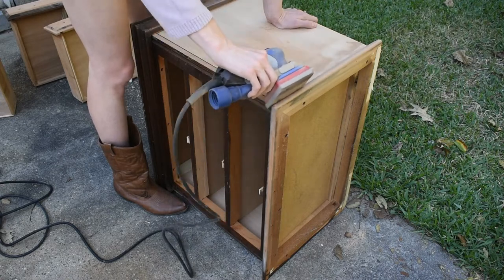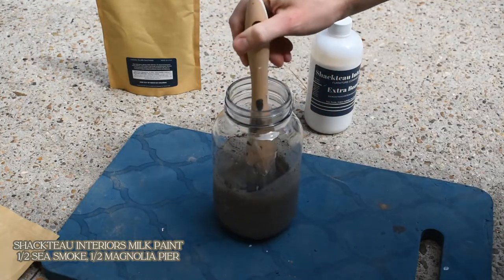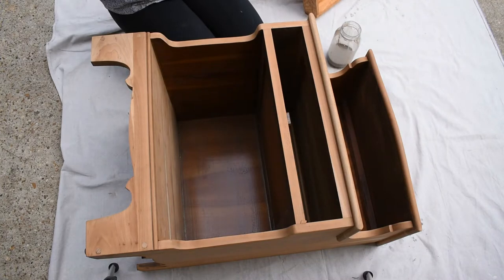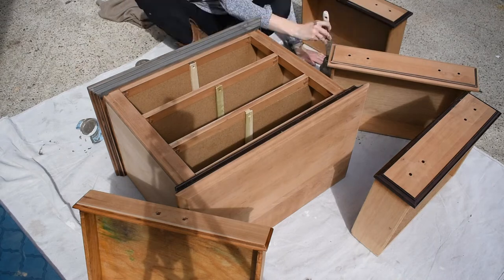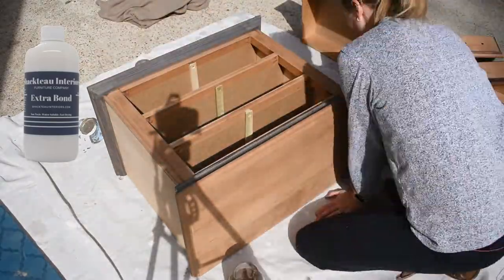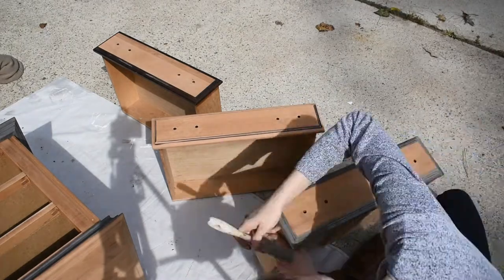I did make sure to give any of these trim pieces a really good scuff sand — this will be important for adhering the paint later. Once all that sanding was done, I busted out the milk paint and started mixing up a custom color. I used a combination of magnolia pier and sea smoke milk paints. I want to say this was intentional, but honestly they were the only two colors left in my drawer, and I've used their combination before for a wash over natural wood. It creates a really nice warm gray color depending on the proportions that you mix — a great universal shade I can use with any tone of wood. Milk paint does not adhere quite as well as chalk paint, but I love its texture and finish a little bit better, which is why I'm using it here.